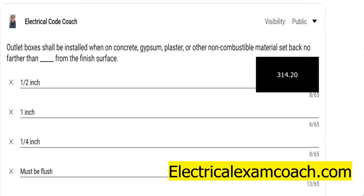We're going to find this in NEC 314.20. It says installations within or behind the surfaces of concrete, tile, and so on and so forth, shall be made so the front edge of the box or plaster ring or extension ring or the listed extender shall not be set back farther than one quarter of an inch. So you're allowed to have up to a quarter inch of it set back in the wall.